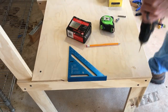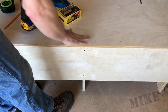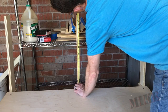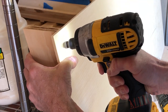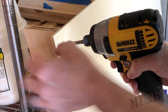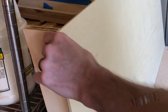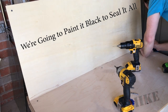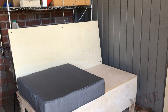I put it on the center front there, just one screw in each one, and now I'll measure for the back, making sure they're all the same. The back is only quarter-inch plywood, because that's all it needs — there's really no force on the back. So drill, countersink, and put the screws in. Make a mark for my lower set, and let's do a test fit here with the cushions.